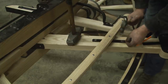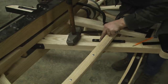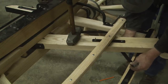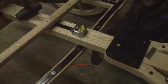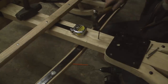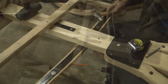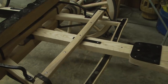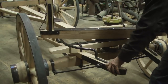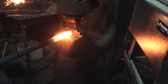The reach gets rub irons for the upper and lower sway bars. And the top of the kingpin gets a broad, shallow head. This gear also needs a mechanical brake system, so I'm going to make the brake lever out of 1¼-inch round rod.